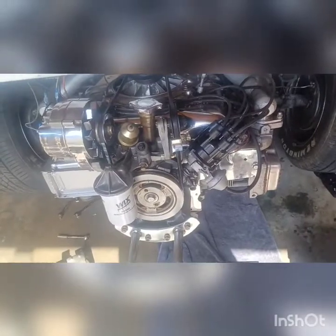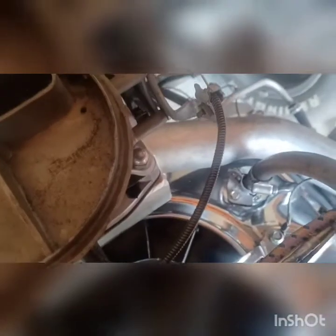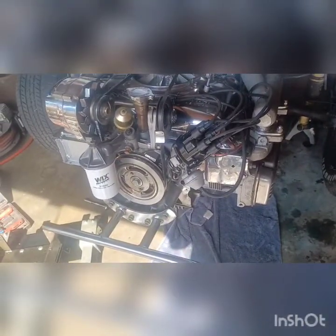We put that deflector on that side and on this side as well, painted with aluminized high-temperature paint. So the engine is pretty well sealed up now from a standpoint of cool air not shooting out little holes everywhere. That's pretty important because you can drop valve seats eventually, especially in the 140 engine if you push it hard.